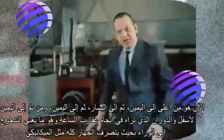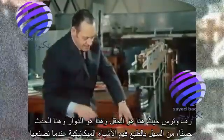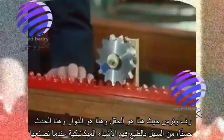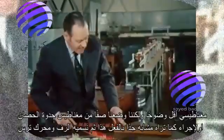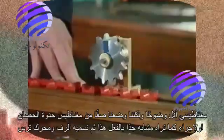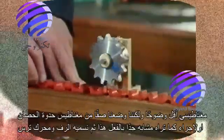So the whole machine behaves like a mechanical rack and pinion, in which this is the field and this is the rotor. Mechanical things are easy to understand. When we make it magnetic, it's a little less obvious. But we put in a row of horseshoe magnets, and the action is very similar indeed. This, then, we call a rack and pinion motor.